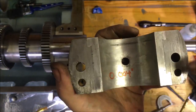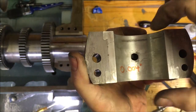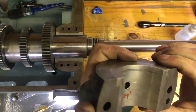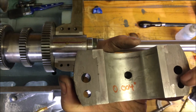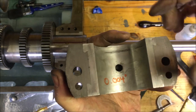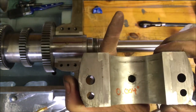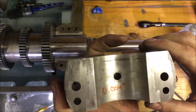And these things are made up with a dovetail, which I think runs all the way around, and then they are sort of circled in. There's no fixing that I can see. So I've got to make sure that when I'm cutting it, I don't shift it all out and mess up this face. So I'm going to clamp it in the vise like that on the shaper and cut across. As I say, probably take off 10 thou. I'll have another think about that before I start chopping away at it.